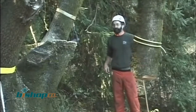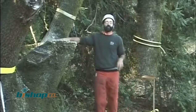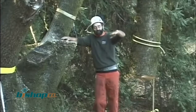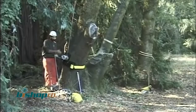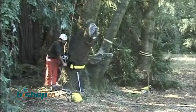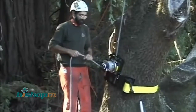What we're going to do here is I'm going to go over to the winch, take the handle out, release the load until the piece is nearly touching the ground. I flip the pigtail up, I keep tension in the tail, and I keep the rope wraps perpendicular to the drum, just as they're wrapped on the drum. So I've got some tension in the tail. It doesn't take a lot of work to do that.